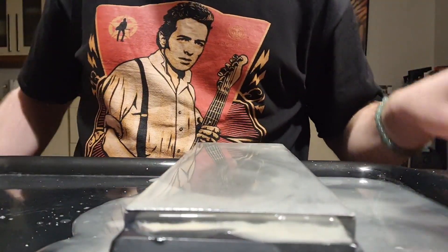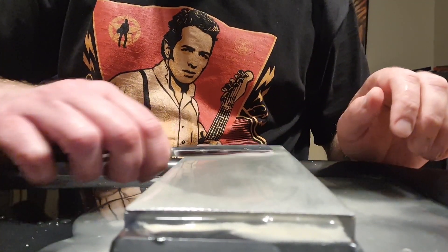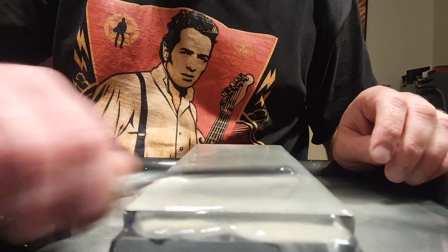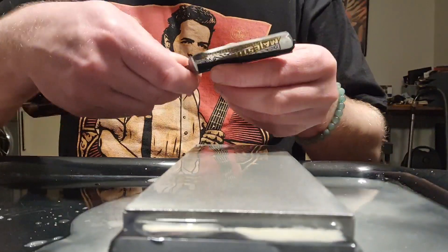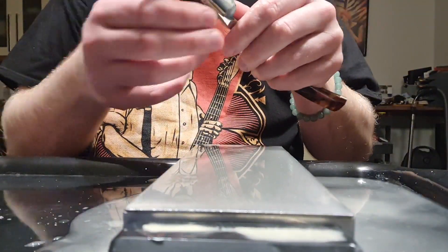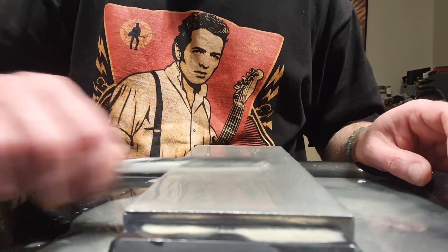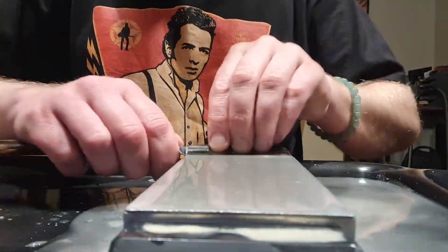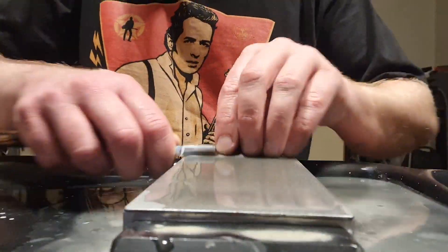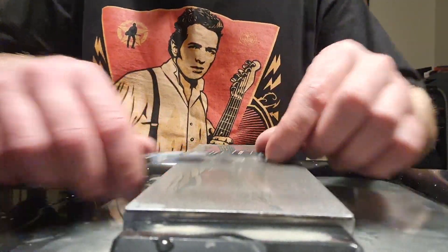It's a very, very flexible, thin blade — extremely thin, so it's very flexible. I have to be extremely careful with the pressure I'm putting on the blade. Let's try to remove this oxidation and flatten the blade again — flatten the bevel, because it was definitely not flat.